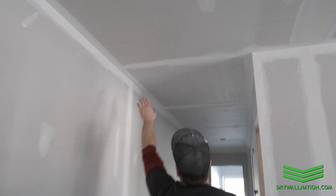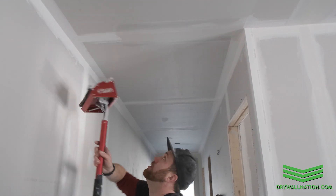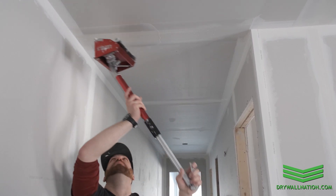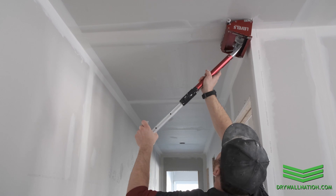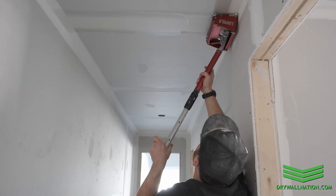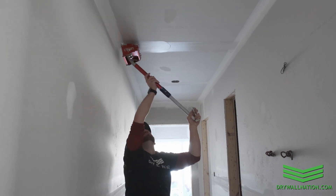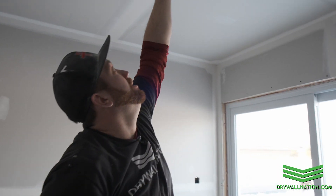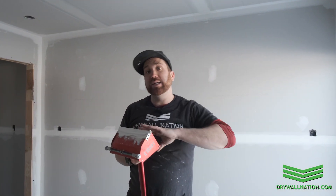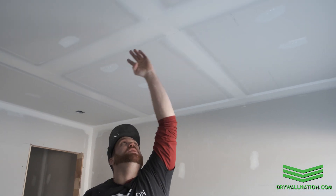In an instance like this short seam between two walls, there's nowhere for me to pull off so I have to leave a lap mark right in the middle. I'll go one way, come back the other way, and go over the whole thing again — the lap mark is unavoidable here. All along this ceiling we're going to have a little lap mark in the middle of this seam because we're finishing between two finished walls. Those little lap marks we just pre-sand between coats. After this 10-inch coat dries we come back tomorrow and pre-sand, then our next coat will be a 12-inch box, overlapping the seams by an inch on either side and filling it very nicely.